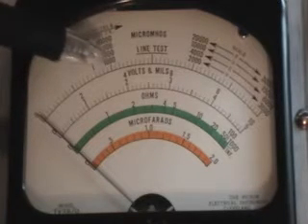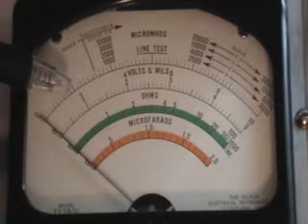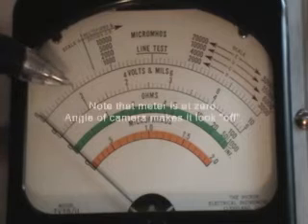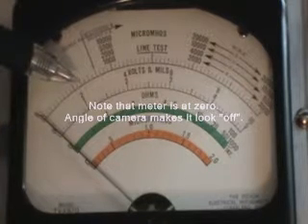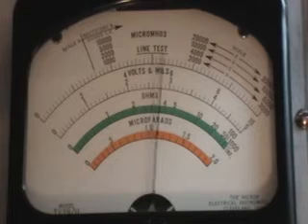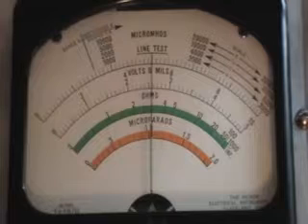This tick mark being 5,000, this tick mark being 2,500. Minimum for this tube would be 3,150 — right in this range being minimum — and you will see here that we get about a 3,500 reading; it should read somewhere in this neighborhood. First we'll do a line test, make sure our line test reads, and we're right on.